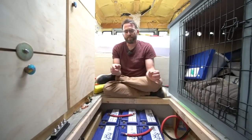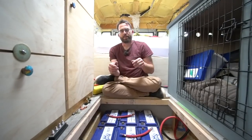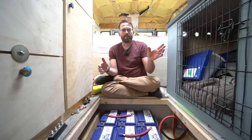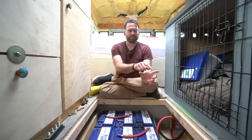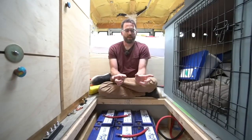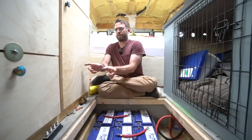When you put it in series, every time you put a negative to a positive and a negative to a positive, it adds the voltage together — it's additive. So if you have a 3-volt battery and a 3-volt battery, you'll have 6 volts from here to here. Or if you have a 12-volt battery: 12 and 12 gives you 24, then 36, then 48.